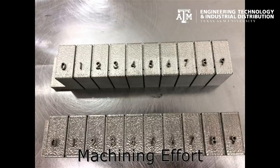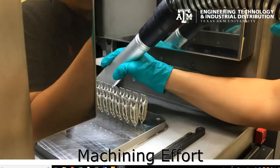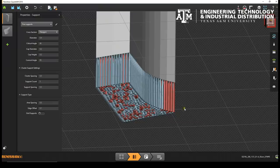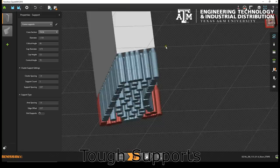The ideal case for the machine operators is usually a part with a small footprint that is supported by a few thick supports. When the part has a large overhanging surface, the internal stresses that build up in the part are often enough to sever the connection between the support and the part. If the support connection is increased, the supports become very hard to remove. Strong supports that are densely placed are often impossible to remove without performing ceramic grinding.